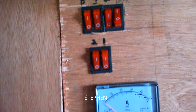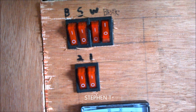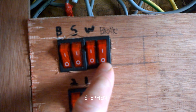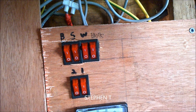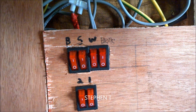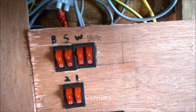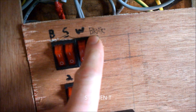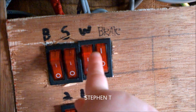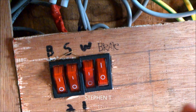I've just crossed the three phases from the supply of the wind turbine and it's in the contactor. When I release it, it releases the contactor and it's free to spin. When I press it, it crosses the phases again on the contactor and then it just acts as a brake. Very simple and effective.